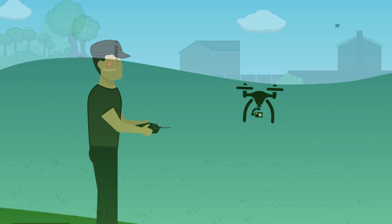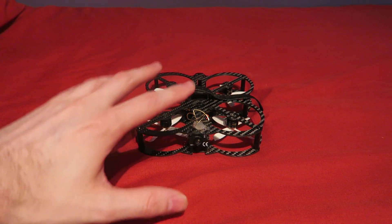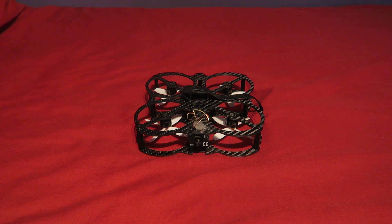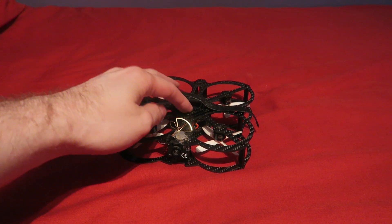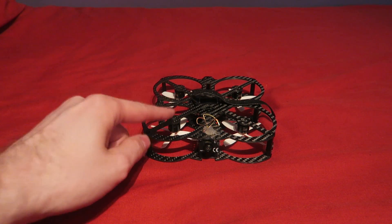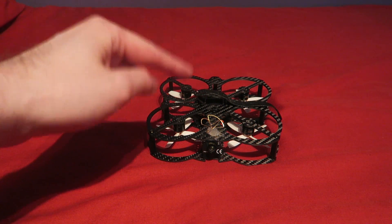Hello and welcome back to my RC channel. I'm Andy RC and today I'm going to be doing a quick build of the Lady Owl. If you are a subscriber you may have seen my in-depth build of the Mini Owl — this one's going to be a lot quicker, just covering the main parts. This is also a more simplistic build with the FX797 camera bolted at the front, a regulator powering it, and a beeper rather than an on-screen display. I'll also show how to change motor direction with BLHeli and the setup in Betaflight.